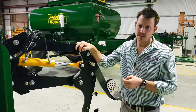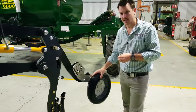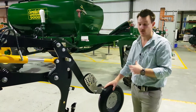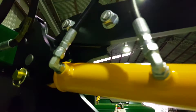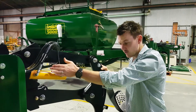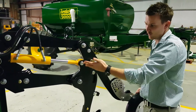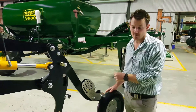The other big thing we really wanted to achieve with this unit was the ability to vary our breakout and our press wheel pressure somewhat independently. In a lot of cases those are tied together very finitely, and you can't adjust one without backing off your shank — so as a result you tend to overpack or underpack. What we've done is used a cam in the headstock, which has three positions for light, medium, and heavy press wheel pressure. We vary our hydraulic pressure via our accumulators, and by changing the cam position we can change how much pressure we put down on the ground. It changes the angle and the relationship between where the hydraulic ram applies force and the geometry on the press wheel — and being a parallelogram, that relationship doesn't change through the range of movement.